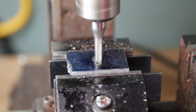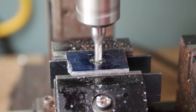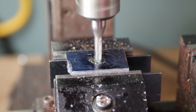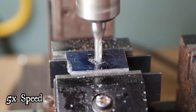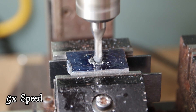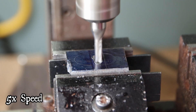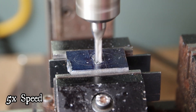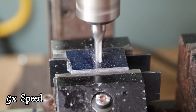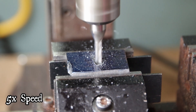Now I'm over at the little bench-top mill. The drill press wasn't able to get enough holes in where I wanted — the bit kept slipping — so I'm using the mill to open that up further. I don't need to take it to final dimensions; I'm going to file it to the lines. I just need to get the bulk of the material out of there.